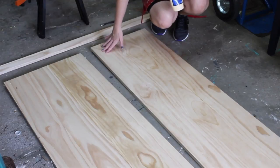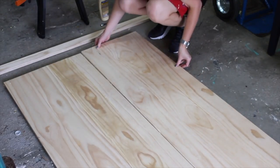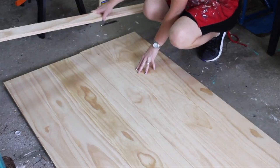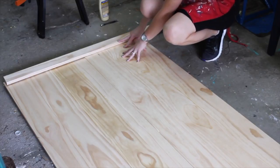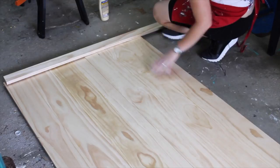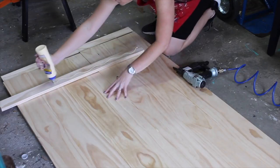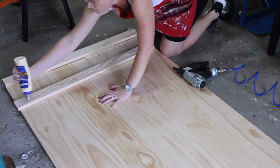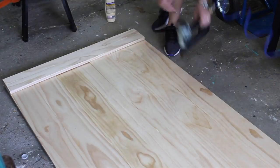What we've got now are two panels that are all glued together and dry. I'm going to add a bead of glue, line the door up, and then add our crossbeams — that's going to hold it all together. I'll measure and cut the crossbeams. At the top of the door we're going to have two crossbeams right next to each other, which has to do with the hardware, and then one piece at the bottom. My pieces are measured and cut, so I'm just going to glue each of these and then nail them with one-and-a-quarter-inch nails.